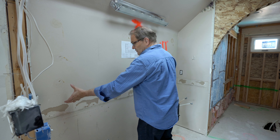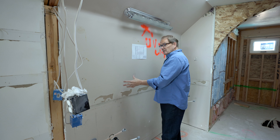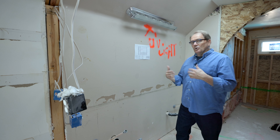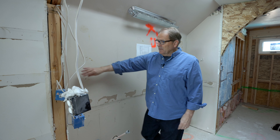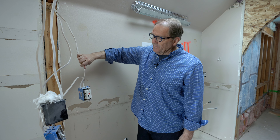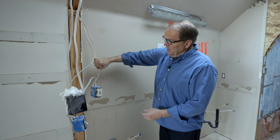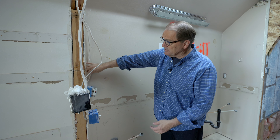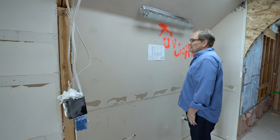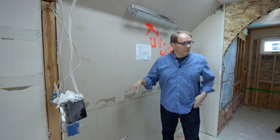As far as plugs are concerned, if this was a mirror plug, they come in and measure the mirror exactly where to cut in those plugs. There are codes and requirements for GFI. This here is an old GFI — a ground fault interrupter — and that has to be within a certain distance of a basin or a sink. There are all kinds of codes with regard to that; he'll follow those. But this here is the roadmap for him.